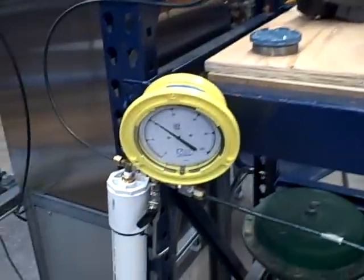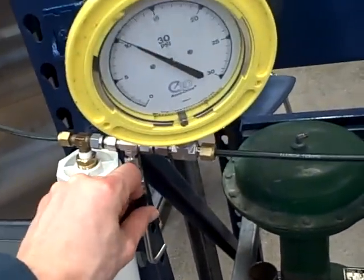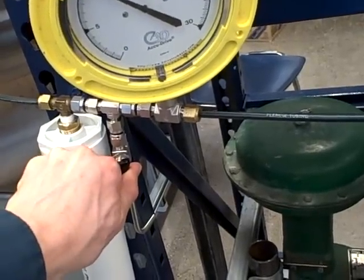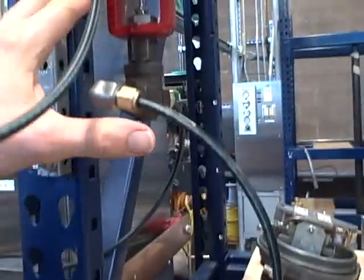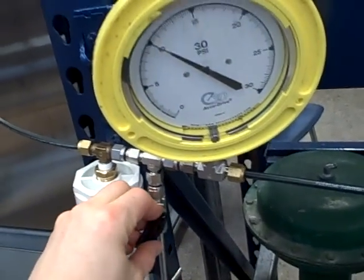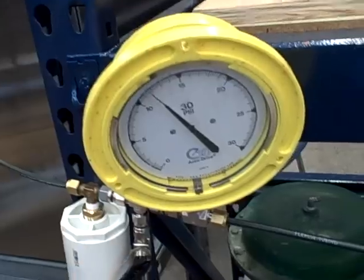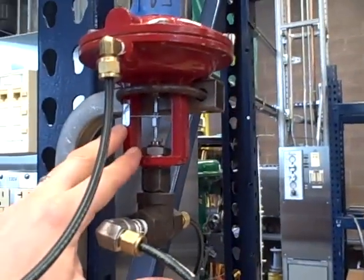We'll show you how this operates. We've got a vent valve that's manually operated — that poses a load to the system. If I open up this valve, it lets out more air. The pressure drops, but then it compensates through feedback control — this valve opens up more, which admits more air into the tank. If I close it down, pressure rises, and the controller compensates by taking that valve and turning it down.